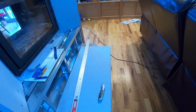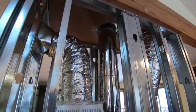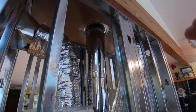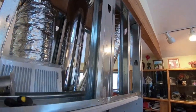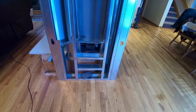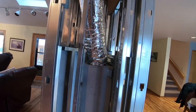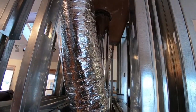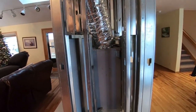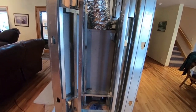Some important things to make sure you follow: you want to have your fire stop put in, which is that metal piece around the chimney. You want to make sure you have the top of your chase sealed. Keep two inches clearance from combustibles. A lot of heat will build up in your chase, so I'm actually going to put another vent up here just to vent the air in the chase out so that any heat in there can escape and help heat the house.